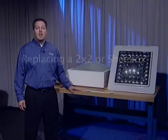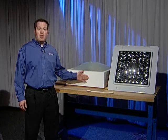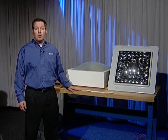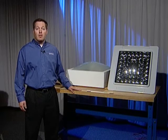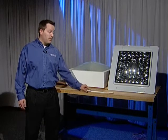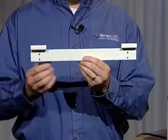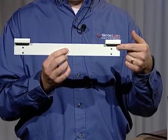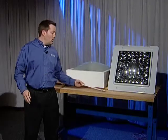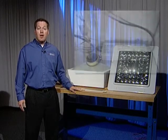For a 2x2 or shoe box installation, Sloan LED recommends that you remove and completely replace an old 2x2 or shoe box, simply because you are relying on an old box to maintain both a weather seal and a mounting structure for a new light. However, the Progressive Series Canopy Downlight has been designed to retrofit to the existing fixture if desired. The hanger bracket can be secured to the flange of the shoe box instead of the canopy skin. Use these holes for boxes 22 inches or greater, and these holes for any boxes that are smaller. The power supply goes up into the old fixture and can be secured with electrical zip ties. The junction box is not needed in this case.